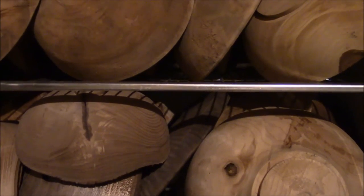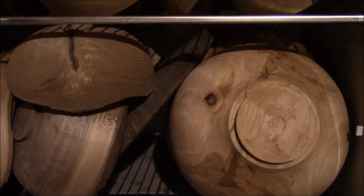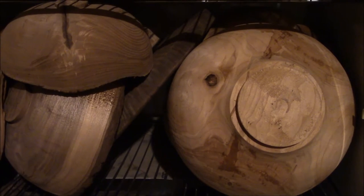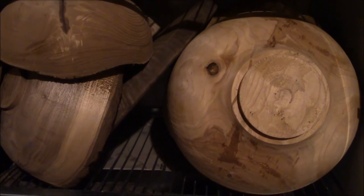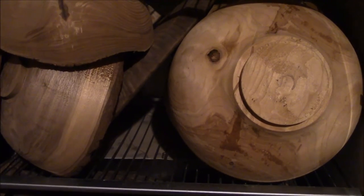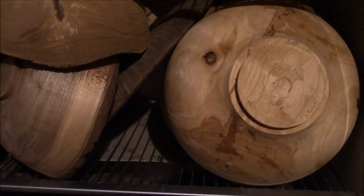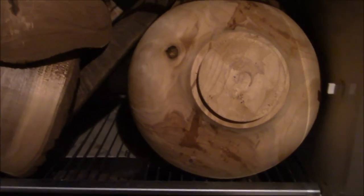I've only seen one gentleman on YouTube doing something similar — he was using a dishwasher and ran his quite hot. This one only achieves about 120 degrees, and that's only at the end of the drying cycle because it starts off really slow with all that moisture in there. It'll only get up to about 75 or 80 degrees at first, but as the days progress the temperature rises. In my way of looking at things, that's a good way to dry a piece — you take the temperature up gradually, kind of the way it works in a dry kiln, just because of the thermal mass of the lumber.